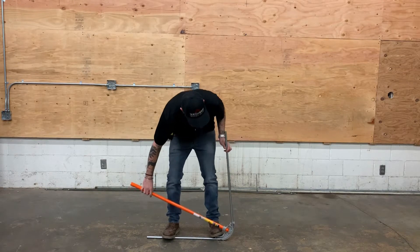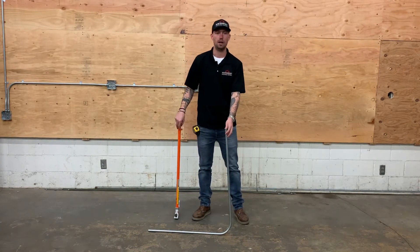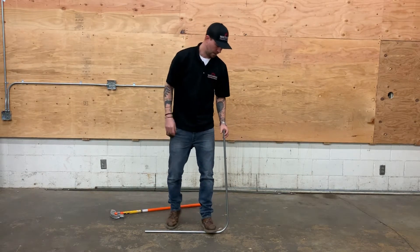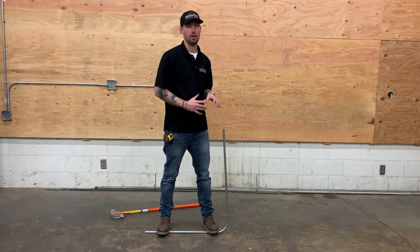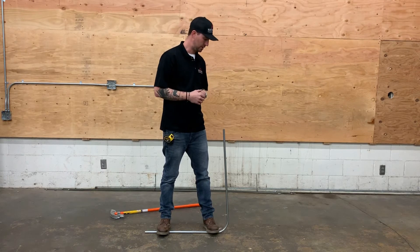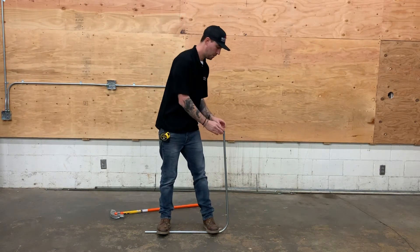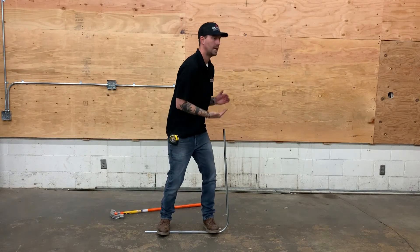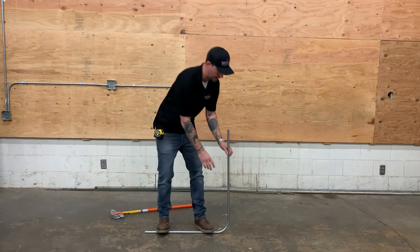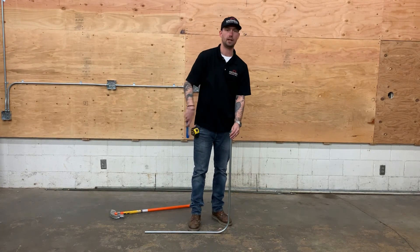Now say I go too far — and these corrections should all be slight. They shouldn't be terribly out of the ordinary. If it's way past or way too little, making hand corrections is going to ruin the degree of the bend. So if I'm a little too far, I'm going to use my hands to correct this. One thing to keep in mind is the pressure and which direction you're correcting — you don't want to correct with too much down pressure as you push, because it's going to flatten out the bend and change the radius and the length. If you want 36 inches it might turn into 35. So when I'm correcting, I'm actually pushing with a slight upward force to keep the bend lifted. I do it a little bit at a time, ease it over, keep looking at it, do my leveling, do my measuring, and I'm good to go.